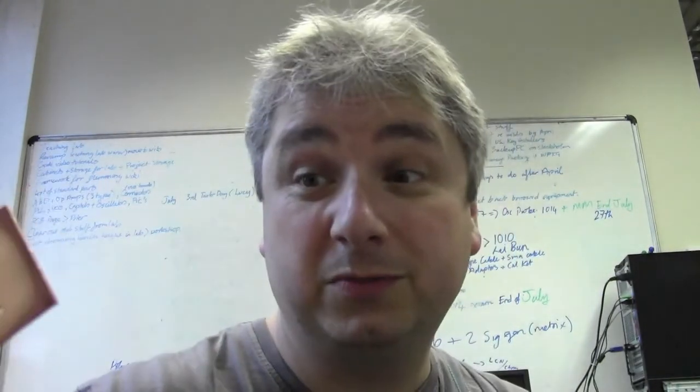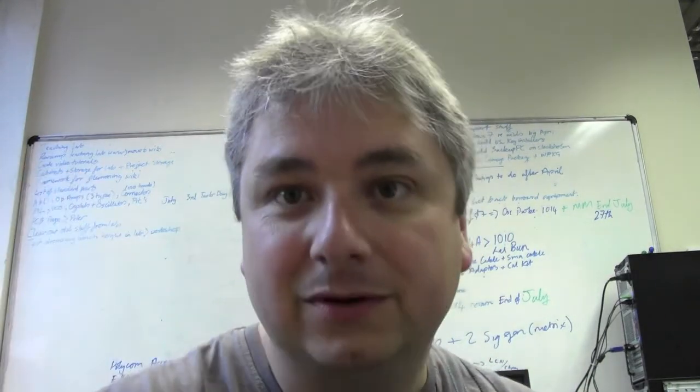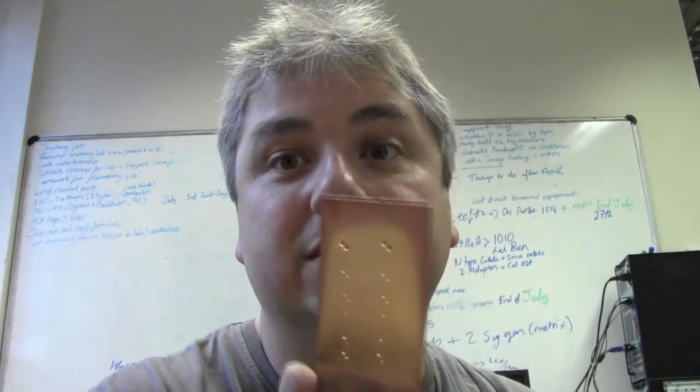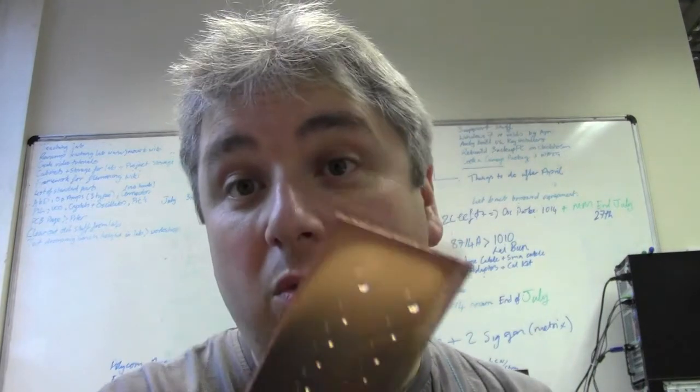Work on your boards as quickly as possible. Don't handle them unless you absolutely have to, and you especially don't want to handle them where you're plating, where your circuits are going. Otherwise you can be immortalised for life in your work, or your plating will fail.